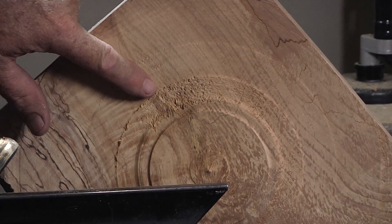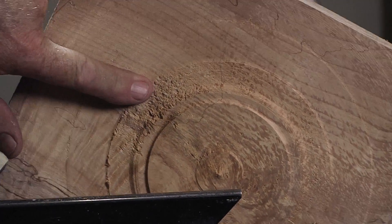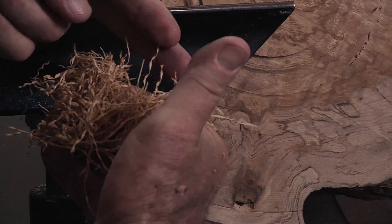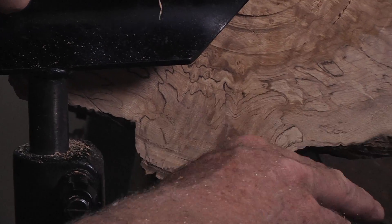Here's our nasty spot — still a little bit of tear-out in there, but way cleaner than what the other ones were doing. You're getting shavings like that, this type with the long kind of curlies in them — that generally indicates you're getting a nice clean cut.